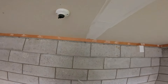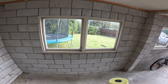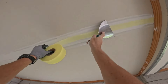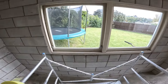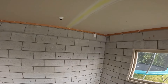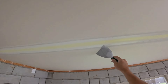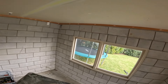So we're just going to start by filling the joint there with compound. I'm just using a 6-inch knife — it's just wide enough to cover and fill that recess across the joint. Once you've got a good coating of plaster on, you don't want to see any board through the plaster, otherwise you could get bubbles if you're using a paper tape. You want complete coverage of plaster over the board, then you can apply your tape. Just push it into the plaster, get it right on there, give it a good press, and clean off the edges as you go. We always want to keep things clean and tidy as we're going along.